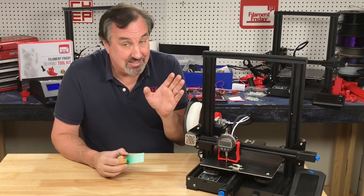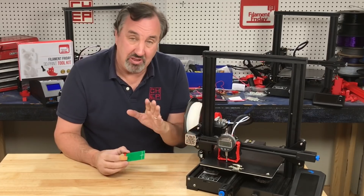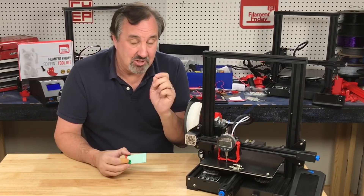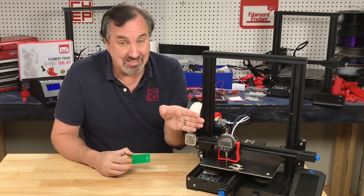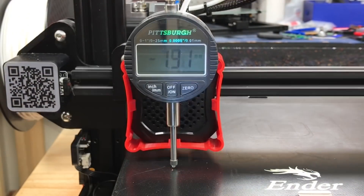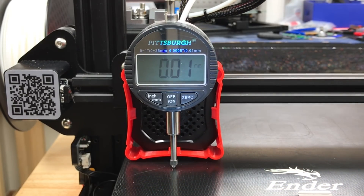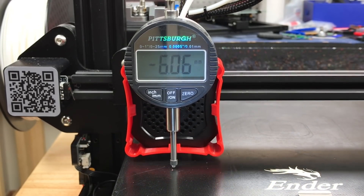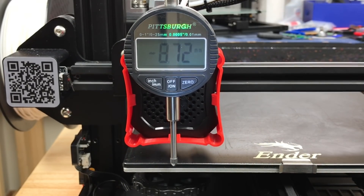Before I test this I want to make sure the setup is actually reliable. The resolution of this gauge is 0.01 millimeters, so anything less than that is not possible. As long as I'm seeing 0.01 and nothing greater, that's essentially spot on. I run the g-code back and forth without measuring just to see how consistent this is. I let it run three times, each time moving above the knob and measuring the error. Each time I'm getting 0.01, so it's consistent and I can trust this setup.